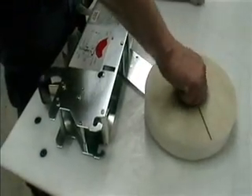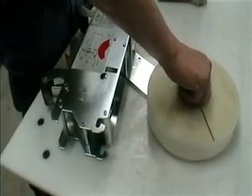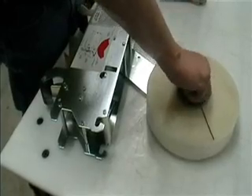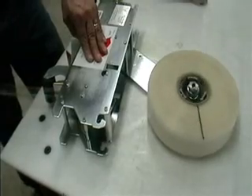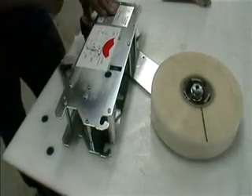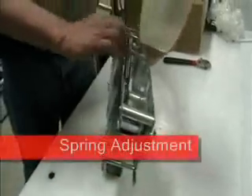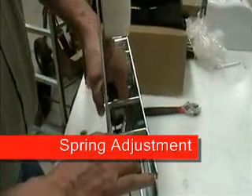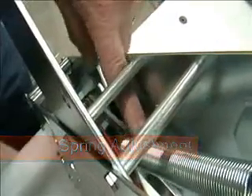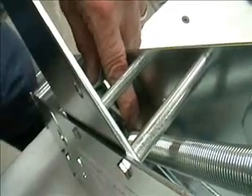So we go back to where we think is good on this adjustment. We'll tighten it up so that the tape ends up in line here. On this tape cartridge, you have your spring adjustment, which has holes in this rail here. It comes from the factory set on the third hole from the back. That is pretty much the median setting.